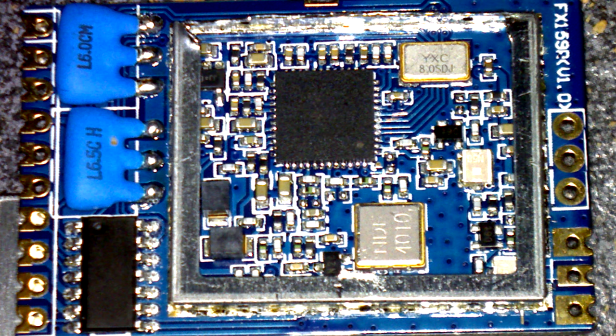Unfortunately, it's not an exact copy of the RX5808, so getting it into SPI mode is a little different, and the pins aren't broken out the same way. Thankfully, it does use the exact same RF chipset, so all the software is exactly the same between the RX5808